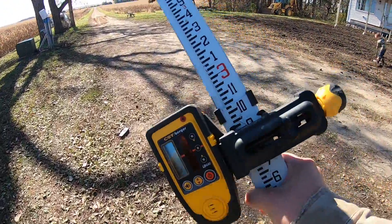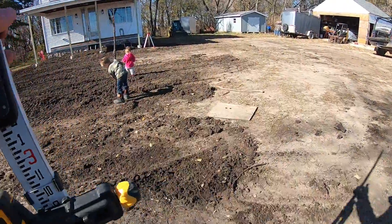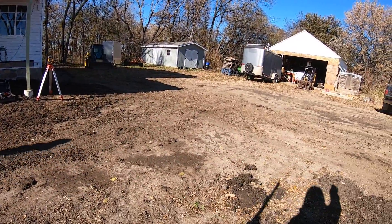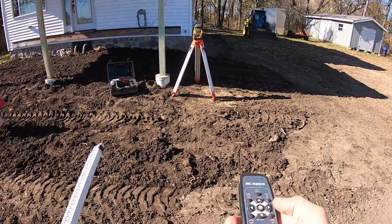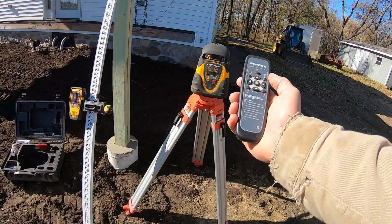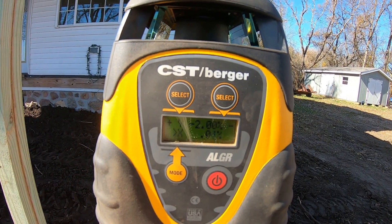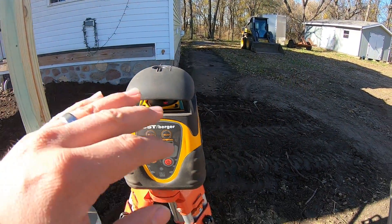So that's some of the basics for how you use a laser level. One other thing I could mention is if you have a pipe that is going coming towards us, but then it's going to 45 and go that direction and then go that way — the nice thing about this is it can do all of that at the same time. We could actually make it slope both towards us and also slope that way simultaneously by changing the X-axis. So I can move the X-axis over and it'll shoot that slope as well.